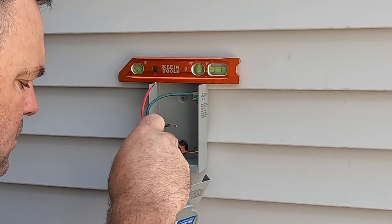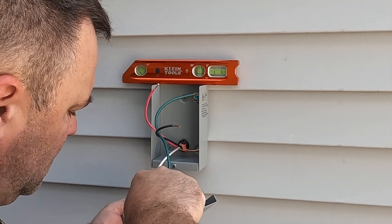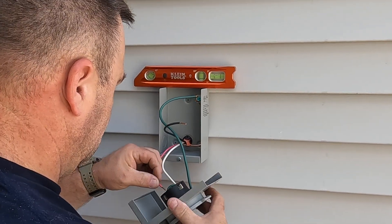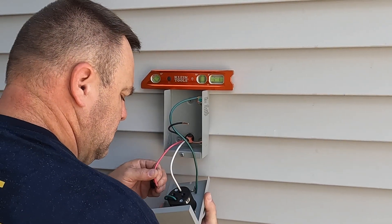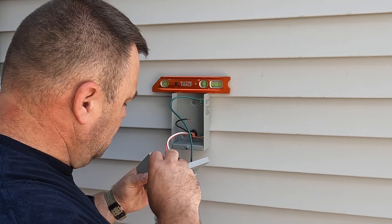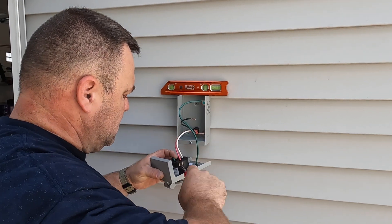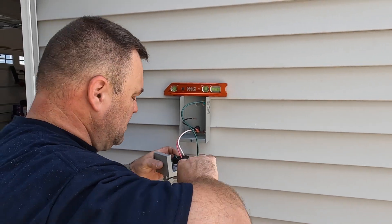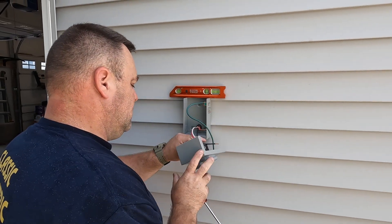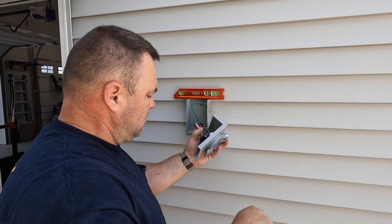If you're going to attach this inlet box and wire it yourself, the neutral wire goes opposite of the equipment grounding conductor — it's marked W. That's got to be in the right place because when you go to plug that cord in later from the generator, you want to make sure you're feeding neutral current through the proper terminals. The equipment ground is already terminated on this inlet box. Remember, the neutral wire always goes opposite of the equipment grounding conductor. You'll have two remaining terminals for your ungrounded red conductor and your ungrounded hot conductor. Pretty simple to wire — just don't make the mistake of putting them in the wrong terminals.